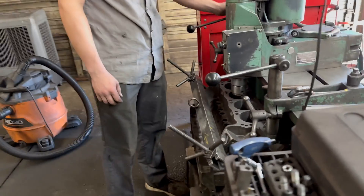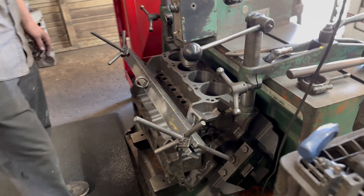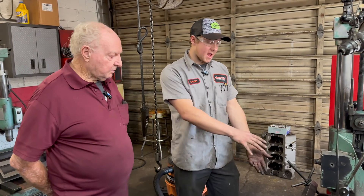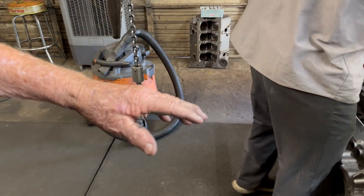That's pretty well done on one side of the motor — it took about maybe 15 minutes or something. It would be easy to just flip it over and do the other side. The biggest thing when we flip this over is to make sure that everything is clean, there's no shavings, so when we reset it back on the machine we're not pinching any shavings and throwing the block out of alignment. We've got a big vacuum cleaner that sits right there in the middle — right there to clean both machines. You can see how the floor is clean here — basically the floor is clean in the whole shop.